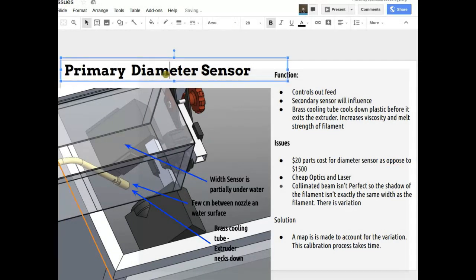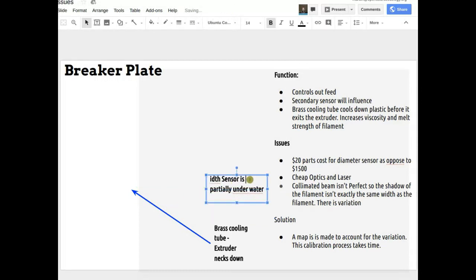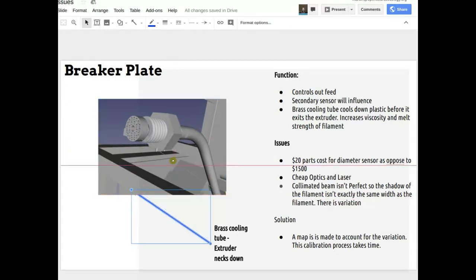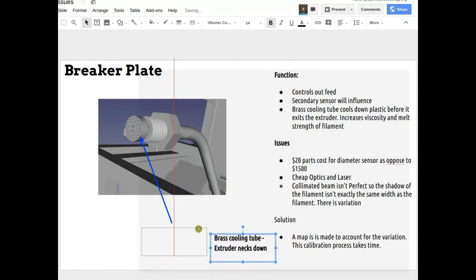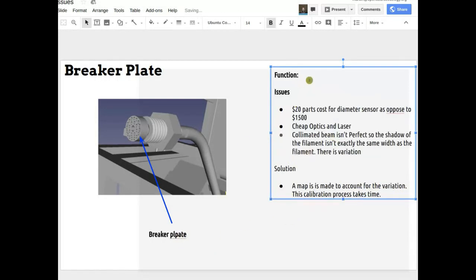In most industrial machines there's actually a melt filter in front of the breaker plate — basically a piece of wire mesh, like a stainless steel wire mesh from a faucet — that filters any junk out of your plastic. The issue is you'll pay a price in throughput with that in there. One source mentioned throughput went down by 50%, though that first depends on the mesh size.